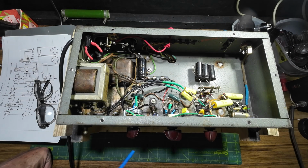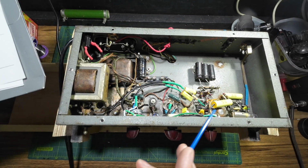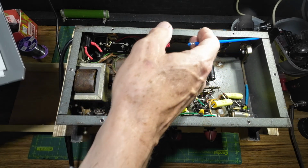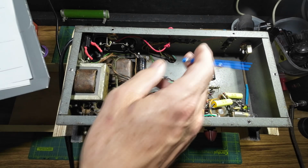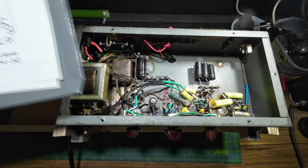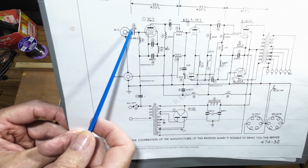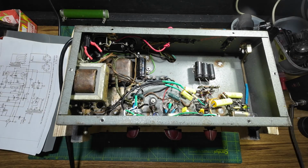The microphone volume, the phonographic volume, which was the channel, well, it wasn't actually all the channel, it was feeding straight into the phase inverter. That had been removed anyway. And if you remember before, somebody put that volume between the input socket and the grid of the 7C7. We've removed that, connected the grid straight up to the 7C7, and I've added that 4.7 nanofarad cap that was missing off here, 0.005, but with 4.7. Unfortunately, I put the wrong one in. It's only 3.3 nanofarad.